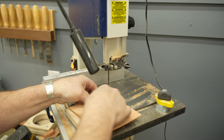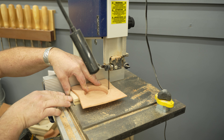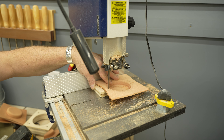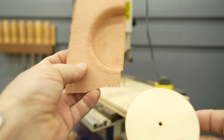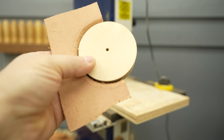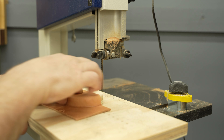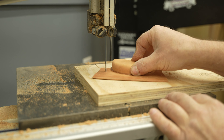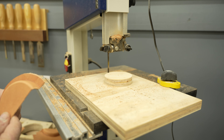After that, I could cut the molded pieces into semi-circles. I used one of the leftover form parts to support the piece, and ran them through the saw. Then I could use another leftover form piece to cut the rough outer circle to match the size of the backs I cut earlier. Once assembled, these will get recut to final size.